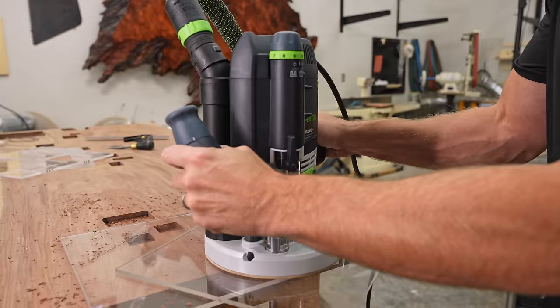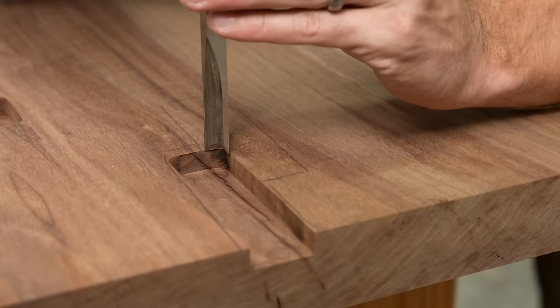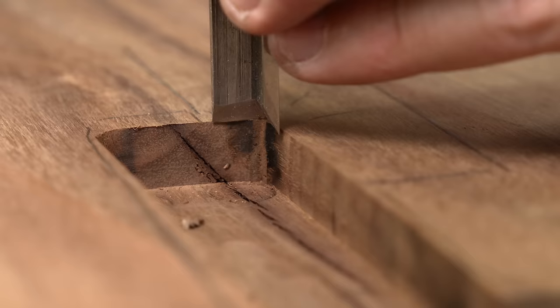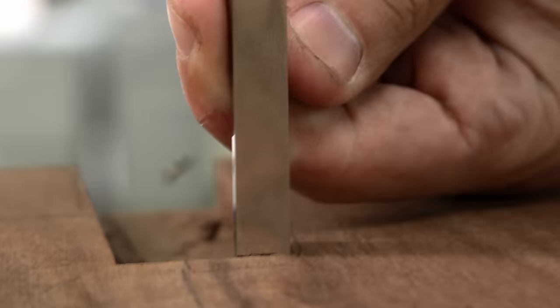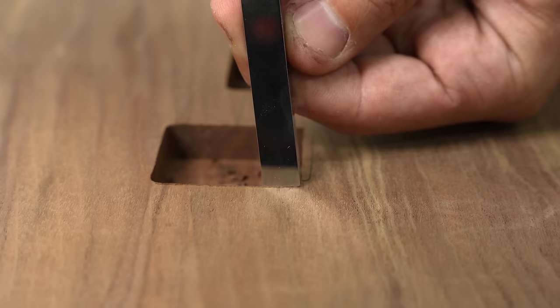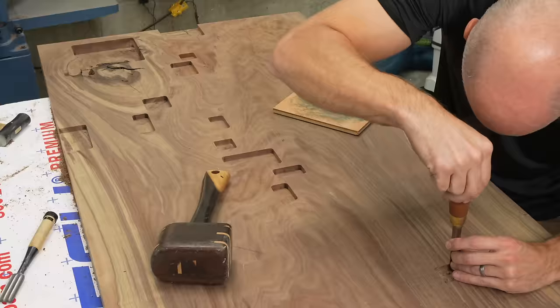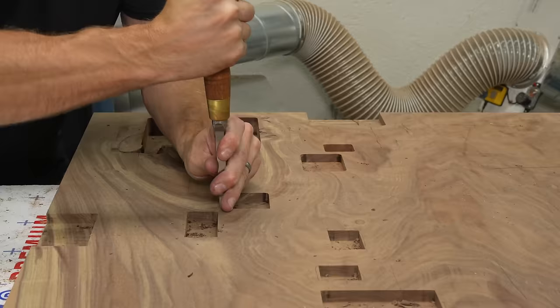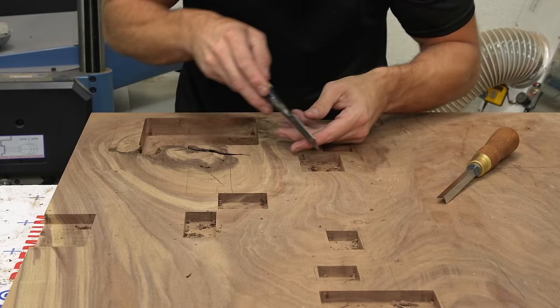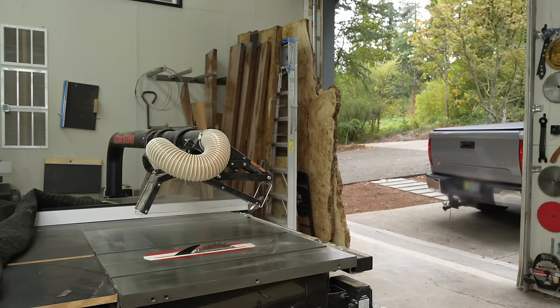Because I'm using this half-inch straight spiral router bit, it does an excellent job cutting straight lines everywhere except the corners, because it can't get past that quarter-inch radius. To clean up these corners and make them sharper, I'm using a corner chisel. You could definitely use a regular chisel, but I got this one for about $30 — it's from Narex. Narex makes really nice affordable chisels, by the way — not sponsored, just something I've picked up over the years. I spent quite a bit of time cleaning up all of these corners, getting me ready for the next step of cutting these square inlays.